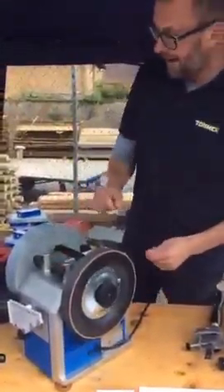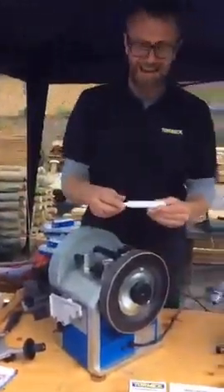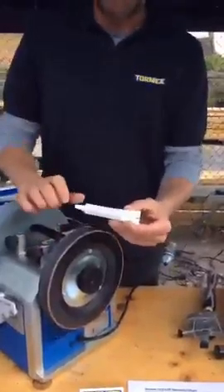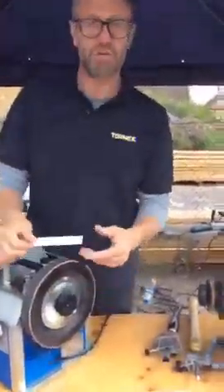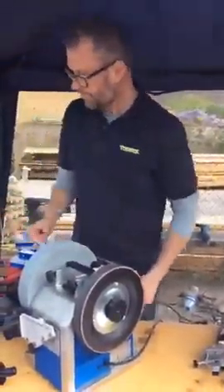Just check I've got it right, and I have. The next thing is something slightly smaller, but to activate that leather wheel is the honing oil wheel, which comes as standard in the pack now — snip the lid, put a little bit of that on, and it just makes sure that's ready to take the compound and work nice and easily.